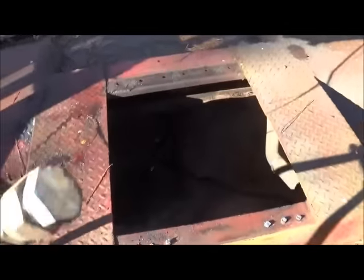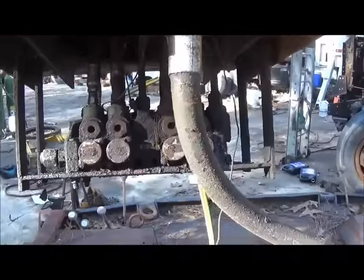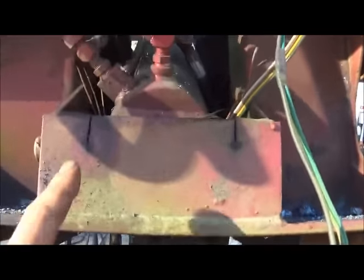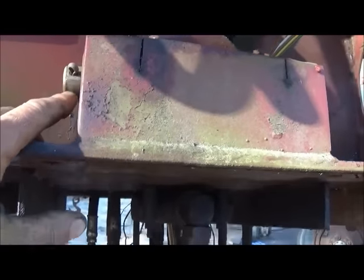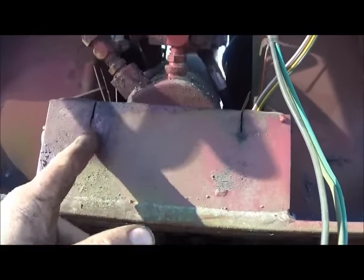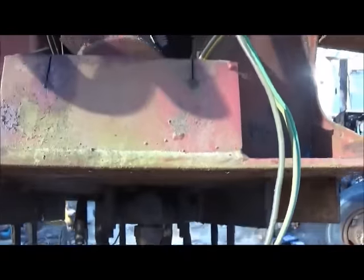This was done by the person I got this from, so that was really good that they did it. You know, pump the tank and this thing would be ready to roll. I can see evidence — you see these cuts here — that tells me somebody couldn't get this pin out. Wreckers are notorious for this — there are no grease fittings for this. What happened is the pin just stuck in there, and instead of being able to knock it out especially when it's mounted, they just took a Sawzall and cut the pin off. You can take it out and drive them out a lot easier.